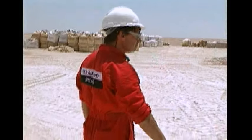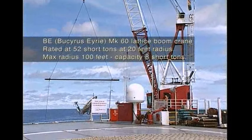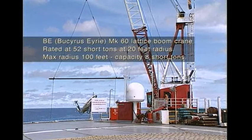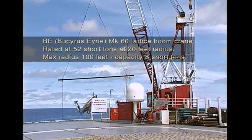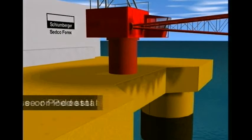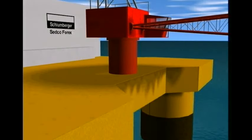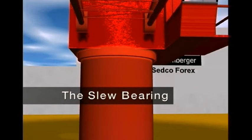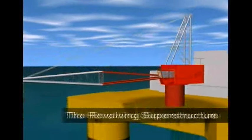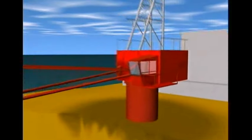There are many types of crane used in the oil industry. We can't show all of them in detail, but here are some of those you might come across. Now let's look at the major components of the crane. The base or pedestal, which is fixed to the structure of the rig, supports the crane and its loads. Above the pedestal, the rest of the crane — supported by the slew bearing — is known as the revolving superstructure. On this there is the cab.